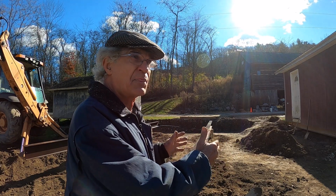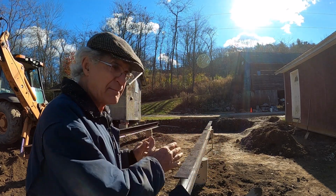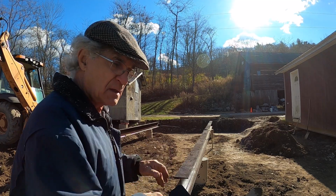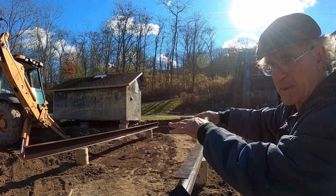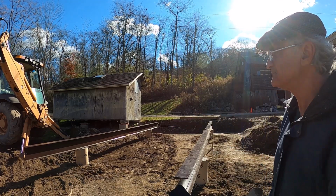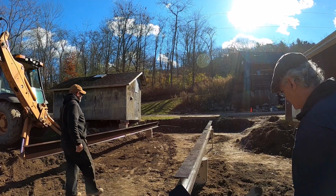Up that are going to go between the two I-beams. Now we're going to go pick them up, we'll put them over here, we'll start bolting them in. That will give us our width between the two I-beams. Once we get them bolted in there, we'll get the laser set up and we'll get these beams flat. Okay, good for now. Let's carry them over here.